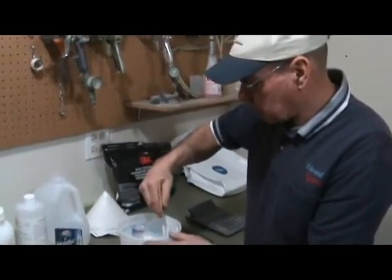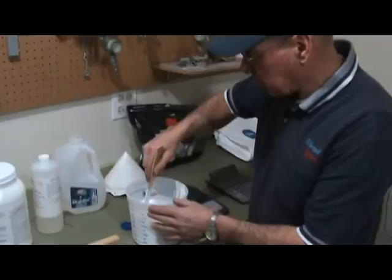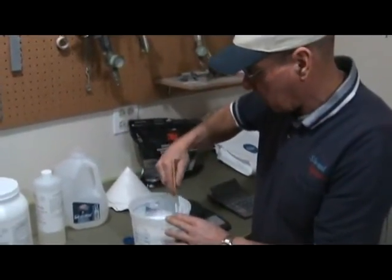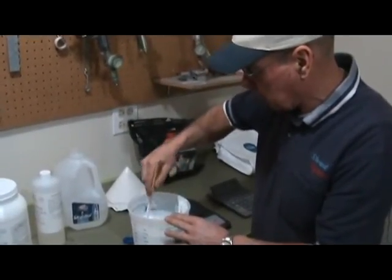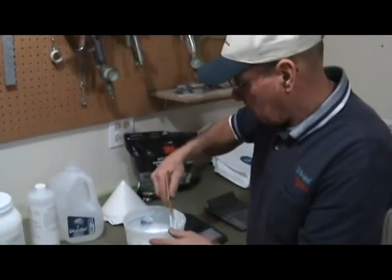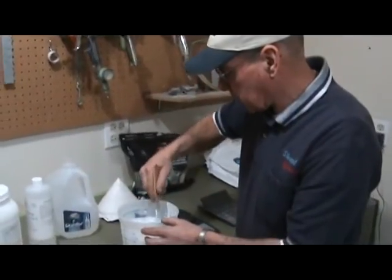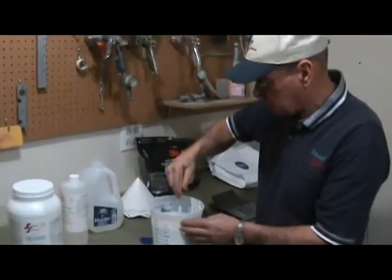If this were being mixed by volume, we would have to use a viscosity cup two or three times because there's no way that we would be able to get the exact amount of water in there. Volume is not close enough to just pour in an exact measurement. Mixing containers, for one, are not accurate enough. We really prefer the weight measure because it works so well, and it gives you time to mix additional paint between the third and the fourth coats.